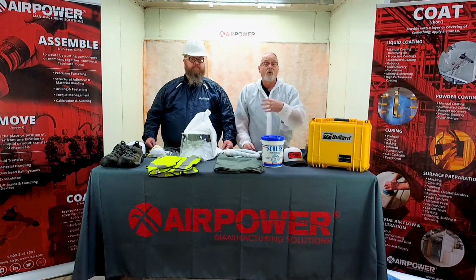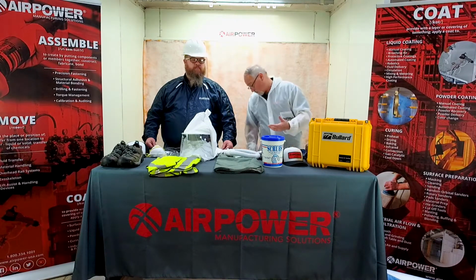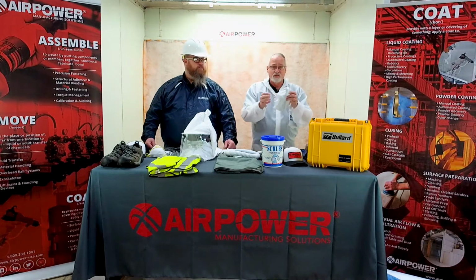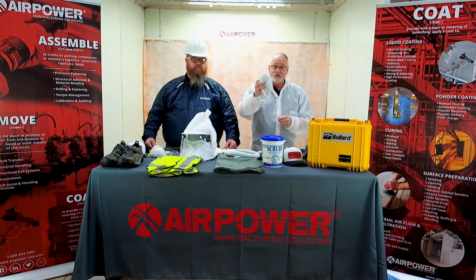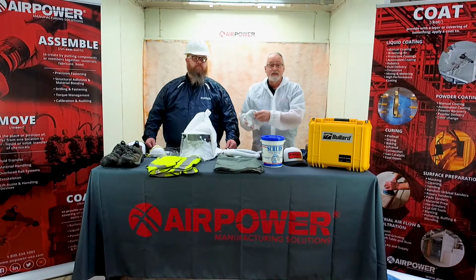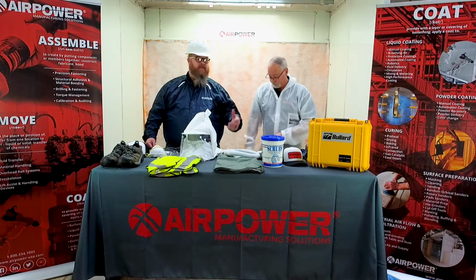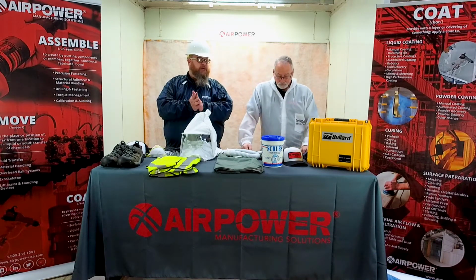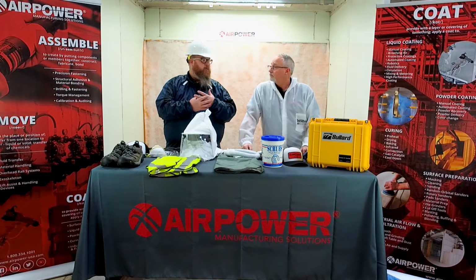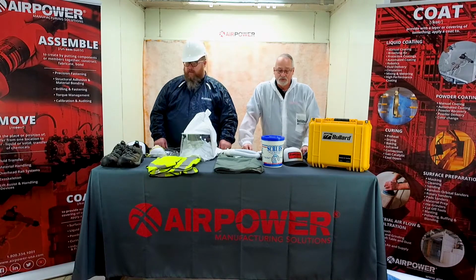They don't have to go into an oily rag can like if you were trying to clean your hands with an old solvent rag, right? So if you just had an old solvent rag dipped and soaked in solvent and you're cleaning all your stuff up, this has to go in an oily rag can that's a special can. It's got to be grounded and all that stuff. If you use this, throw it in the trash. Not to mention the regular exposure to washing your hands in the solvent. It does go into your pores. You do have that, so you want to be careful there. Don't do it. Bottom line, don't do it.